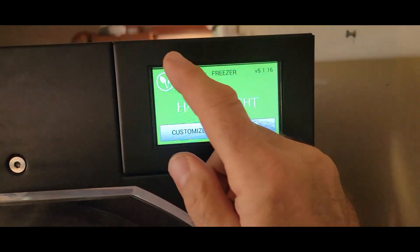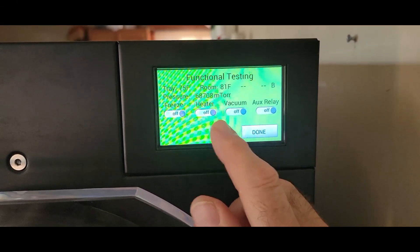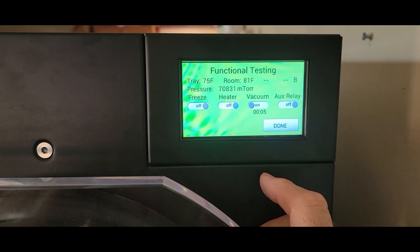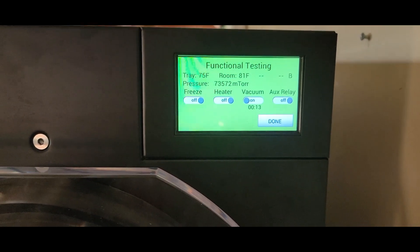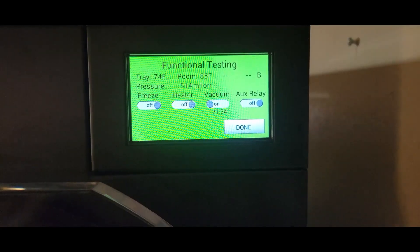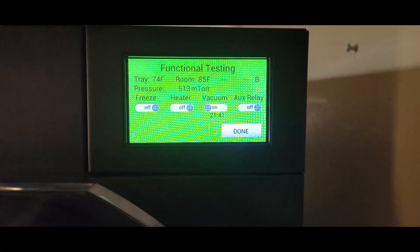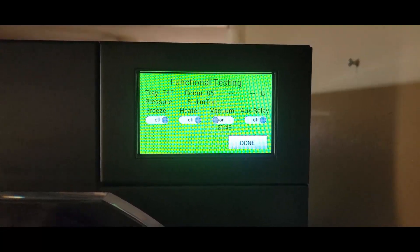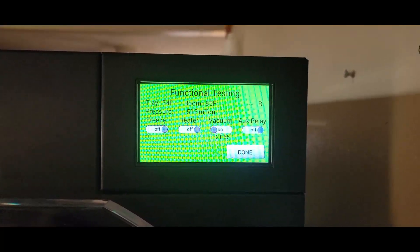Powered back up. Going to the flower icon and turning on vacuum — we're starting at 68,708 millitorr. We can hear the pump starting. After about 21 minutes we're down to 513 millitorr. We'll let it continue to bottom out and then do our spray test to see if the pressure increases — we want to confirm whether the re-seal actually fixed the problem.